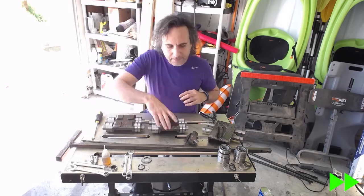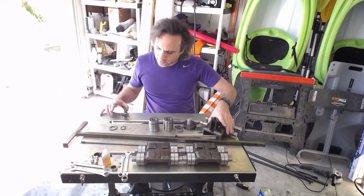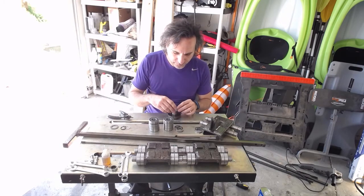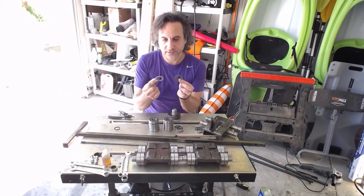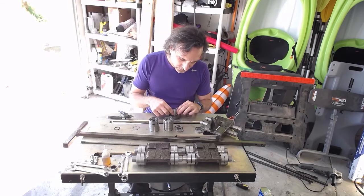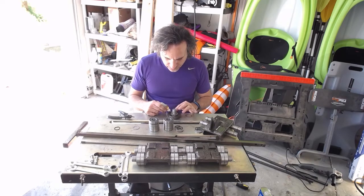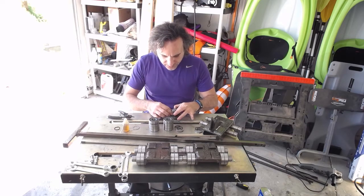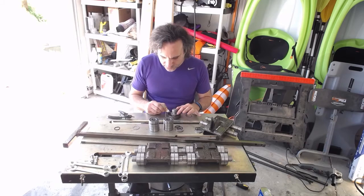I think I will start with the pivoting portion. These washers over here are different from these washers over here. The washers I've been using so far are ones I made, but these I actually bought — they're hardened washers. What they do is they go with this thrust bearing over here. So I'm going to put the thrust bearing down, and this thrust bearing does want lubrication. I'm just going to spin it around and fill it up with oil as I'm doing that.